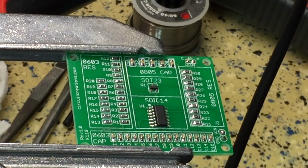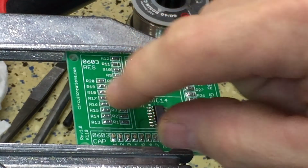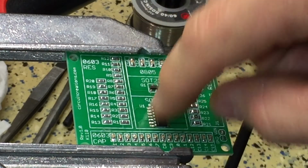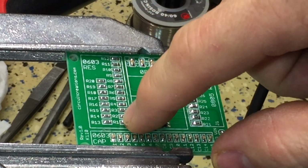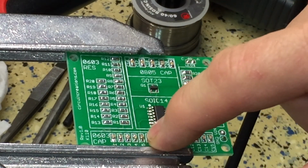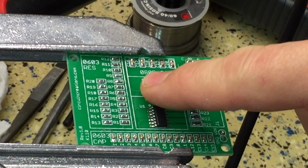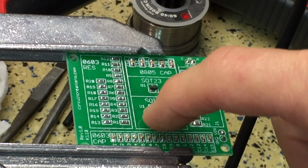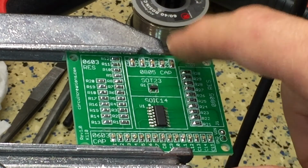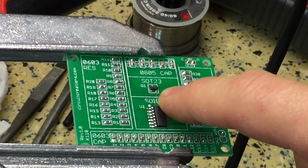Okay, I've been unsuccessful in making this work. I did realize that there is a website here. I was able to get the schematic. I was able to test every one of these resistors that was in play. Not all of these are part of the circuit, and they are correct values, as well as the capacitors here and the resistors here. These capacitors are not in play. Verified my orientation on the parts that matter. I even put in a different LED, thinking maybe I burned up the LED. I verified all the connections to everything.